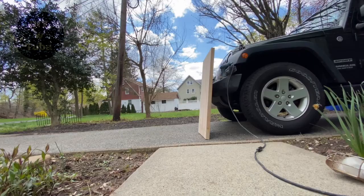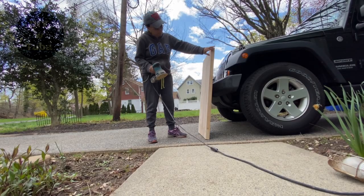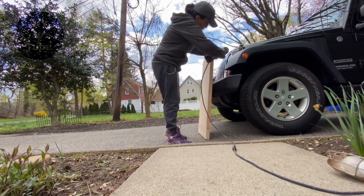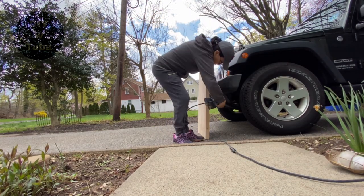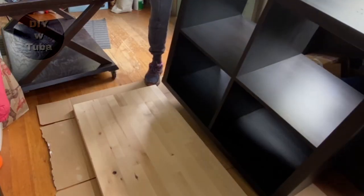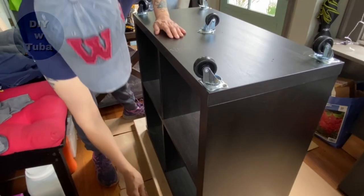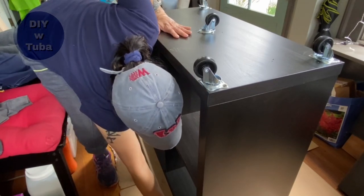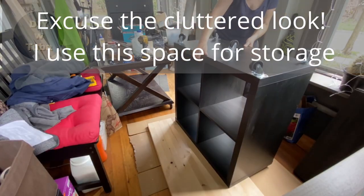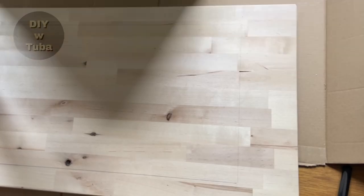All the wheels are installed. Now I am going to sand the butcher block countertop. I got it from Home Depot. It was 24x60 and I got it cut to 20x40 at my local lumber yard. I am only sanding where I have the cuts. I laid the countertop on the floor — I found that easier since I am doing this alone. I am going to mark where it sits on the base so I can put my glue before I screw them down to each other.